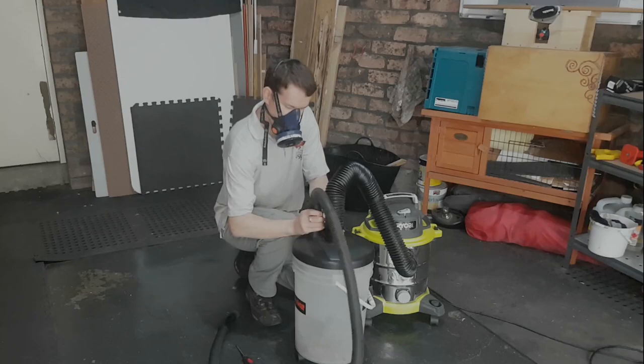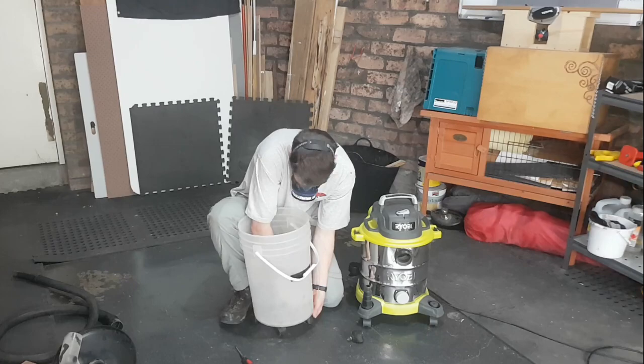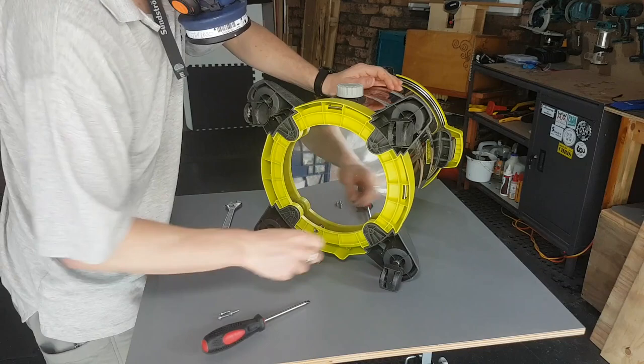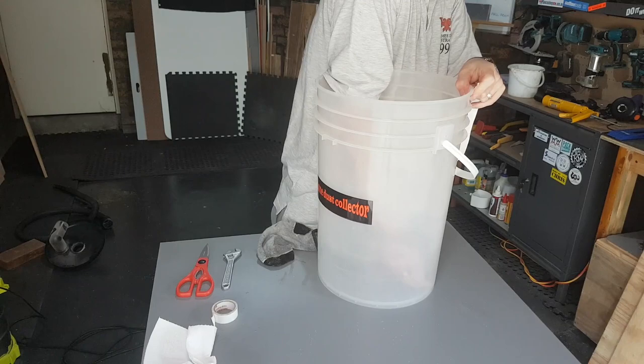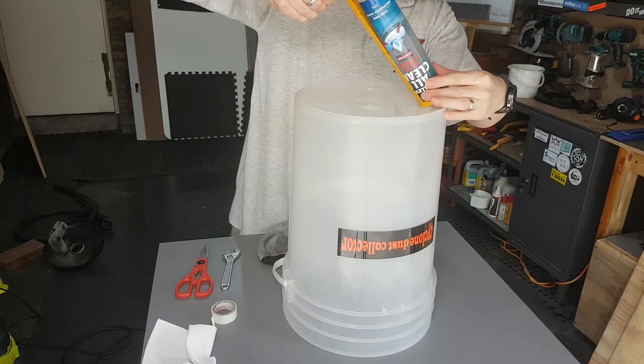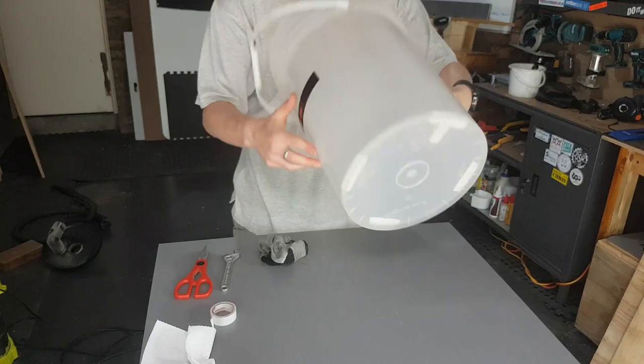That's the project for today. First thing, of course, is to pull all of this apart. Here's my lovely brick that I had in there weighing it down. Get out that little bit of dust and start pulling off the casters. Obviously, you've got to get the wheels off both the cyclone bucket and the Ryobi shop vac — I'm going to reuse all of those later. These wheels had tool holders on them, and that'll come into play as we get towards the end. But first I need to plug the gaps left by the bolts from the casters in the bucket — a little bit of electrical tape down the bottom, just to hold in some Selleys All Clear. Any sealer will do, really. Clean it off with a bit of turps and the bucket is pretty much ready to go.